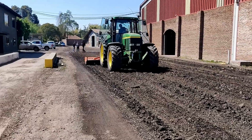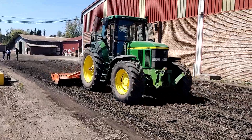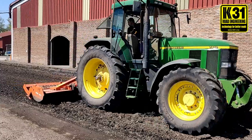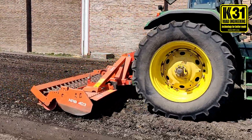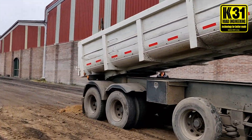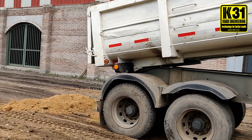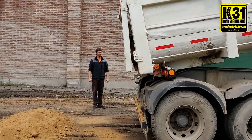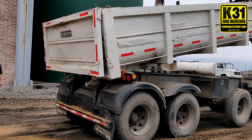After you open the soil with the motor grader, you go ahead and run a tiller. In this case they had a rotary tiller — vertical — but you can use a regular tiller, it doesn't really matter. This one's just wider. What it does is it allows you to chip the soil into smaller particles, which will make it easier when it comes time to stabilize and get a consistent mix.